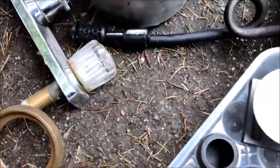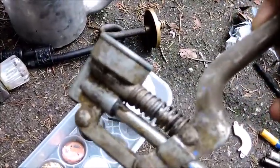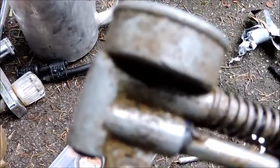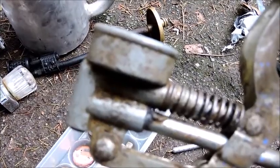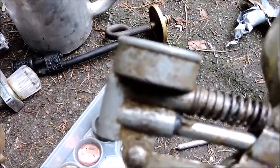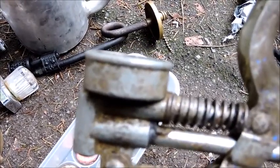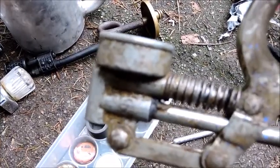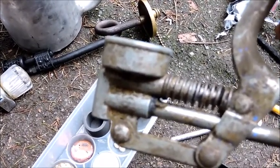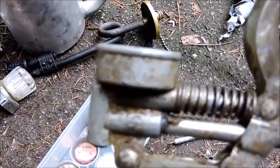Okay. Now, this here is a mini oil gun trigger. The top part here, that could be zinc. I'm not 100% sure. Zinc's very hard to tell apart from aluminum and lead. Well, lead it is easy because lead's much heavier, but aluminum and zinc can be tough items to tell apart. So, just going by the color of this, I would say that this is probably zinc. The zinc seems to be a darker gray. Well, maybe it isn't zinc, because zinc usually corrodes white, and it is a coating for a lot of metals, not an alloy, but a coating to help the metal underneath last longer and not corrode. Now this is probably aluminum or something like that.